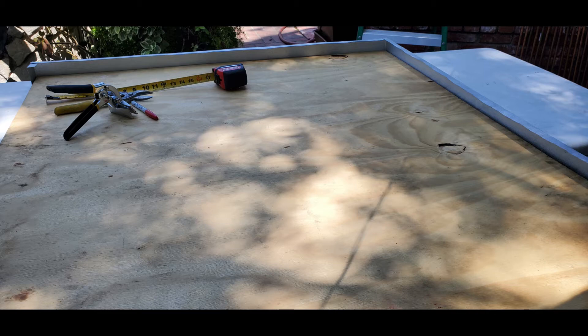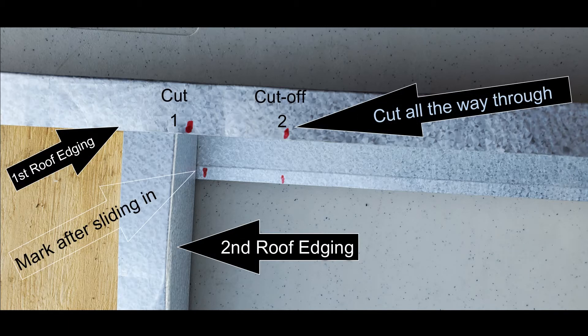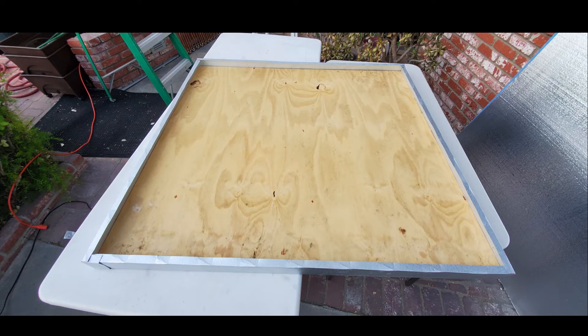The next move is the end cap, where two pieces of roof edging are tied together. It's important to slip the second roof edging underneath the first to get the correct measurement for the outside, since it does widen the plywood slightly. You'll make two cuts — snip the three-quarter inch and the two inch, cutting completely off. The top roof edging bends and covers over the second, so water runs down and is channeled off by the layered overlap.